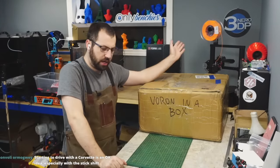Chris, my PEI sheet is amber. Okay, so it looks like they're changing or a different batch or something. I don't know if it's, what is it, PEX? I know Wham Bam started using PEX because it's cheaper, but it isn't as good as PEI. Magnet. 3M 300 LSE is the adhesive on it. I'd rather see 468 MP, but it is what it is.